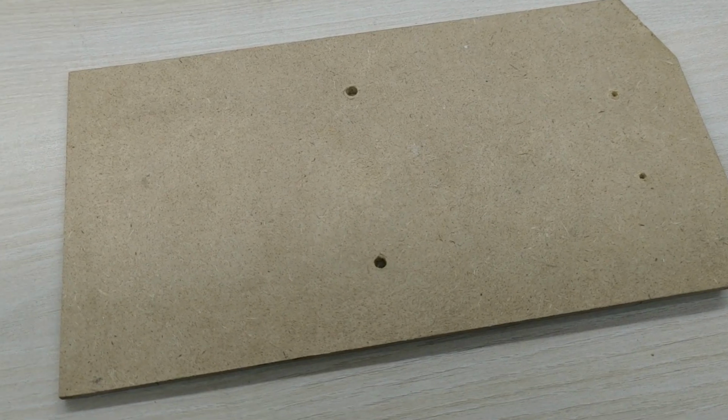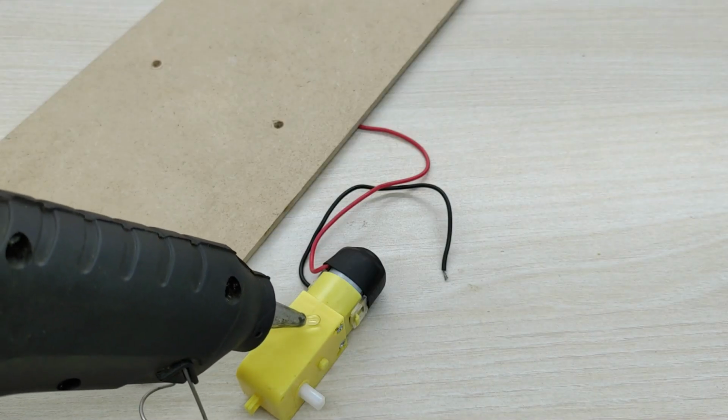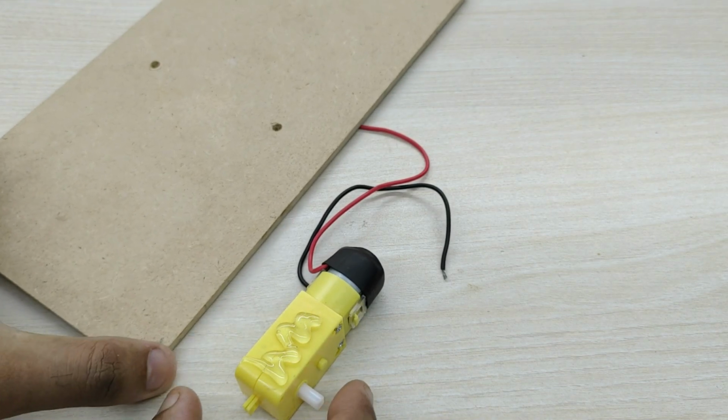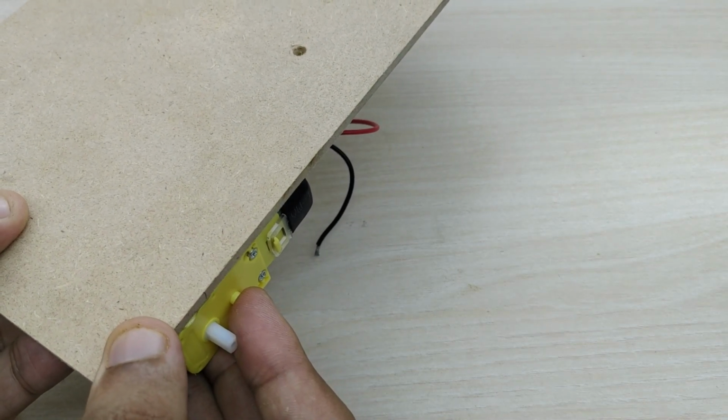First, take a plywood board and cut into the shape as shown. Also make two holes for the motor wires to pass through and also for fixing the caster wheel. The drawing template for the plywood is given in the description box. First, we have to fix the two motors on either sides as shown in the video.